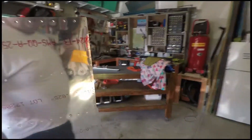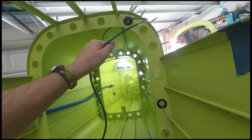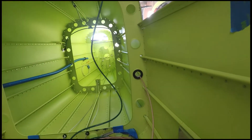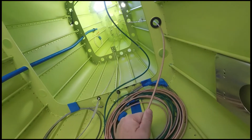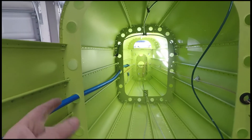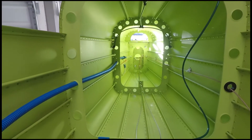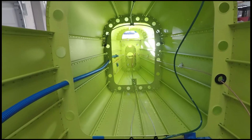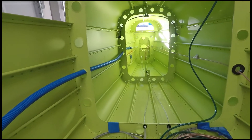The wire on the other side is the static — not a big deal. This is our G400 radio cable, and you'll notice it goes back there with enough length to run all the way up to the top of the vertical stab, because that's where the VOR antenna is going. I'm installing what we call cat whiskers — rods that stick out from the top of the tail for VOR reception.